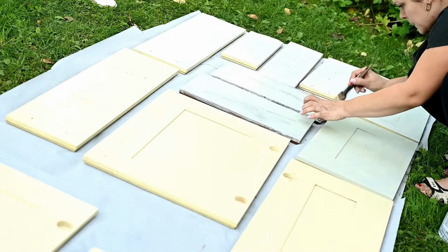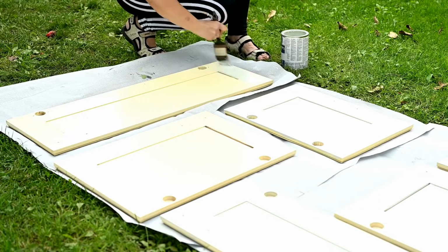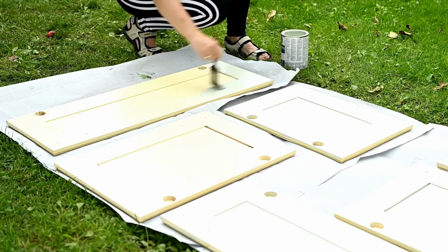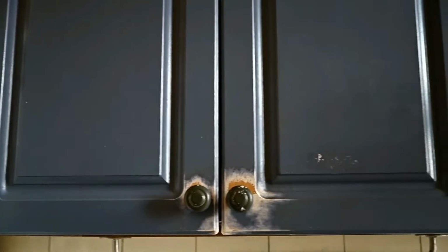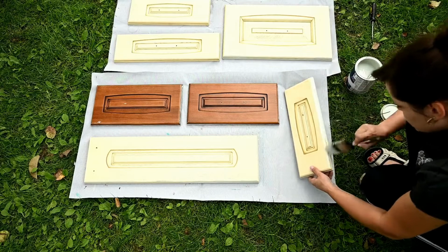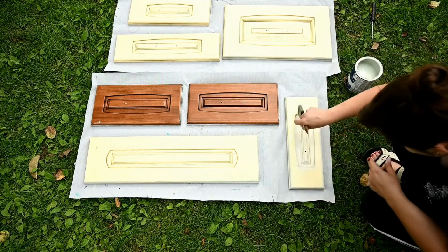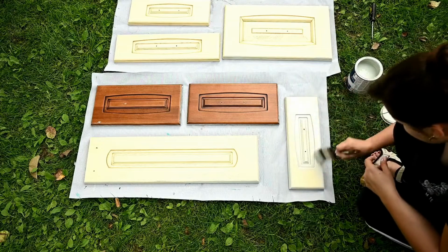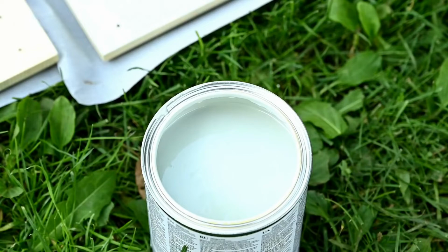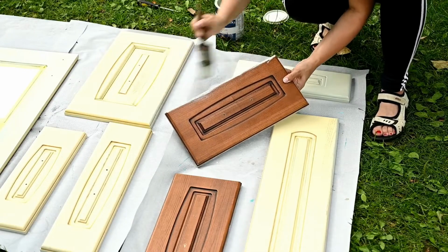When we were doing a makeover in our apartment, I showed our old kitchen to you, which I had painted 9 years ago, and my mistake there was to use white primer with the dark paint without using any sealer afterwards. The paint was worn off after some time in the most used places, and the primer began to show through it. Therefore, now I've taken into account my previous mistakes and I've tinted the primer in the same color as the paint.